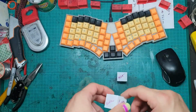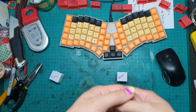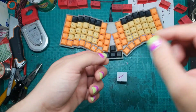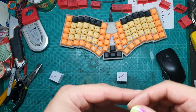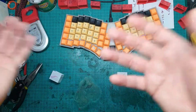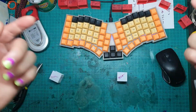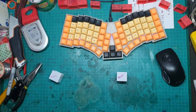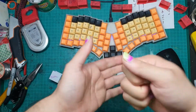And so if you use that 80% on your flow on Cura, and you do some basic prints, say a cube, you probably start to see some weird behavior where you have under extrusion on the top, so there are little gaps on the top of prints, and you probably see a little bit of blobbing around, and some over extrusion on some parts. And that's really weird because supposedly the extruder is perfectly calibrated, but it's actually not, because of this setting that comes on by default on Cura, and that I think, sadly, the concept is great, but it doesn't work, and it creates more problems than it solves. The setting is called compensate wall overlaps.